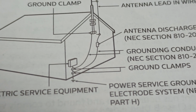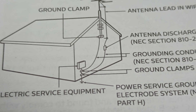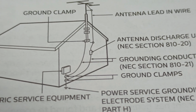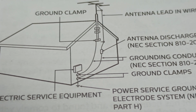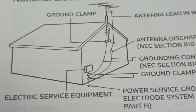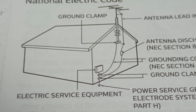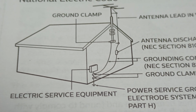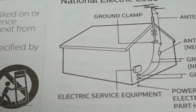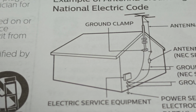Notice the diagram. Those of you that demand authority from some company that made a book, here it is. Only grounded to the service entry ground. Only. Single point grounding. Multiple point is forbidden by Article 250-24A5. You may not put a ham radio in the other end of the house on commercial power and sink another ground rod in the ground. That's several code violations.